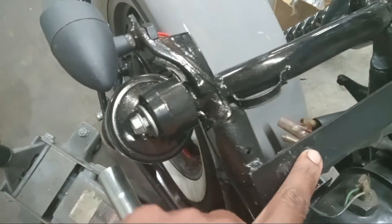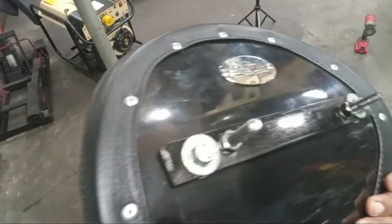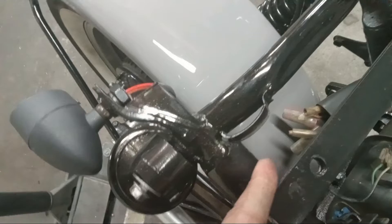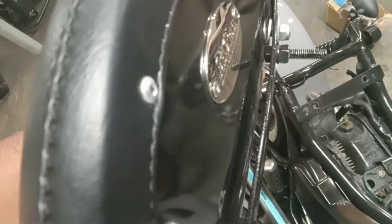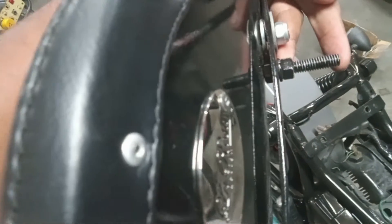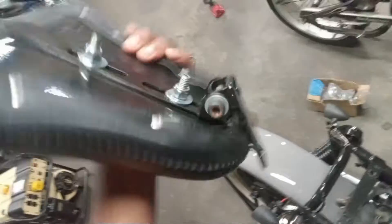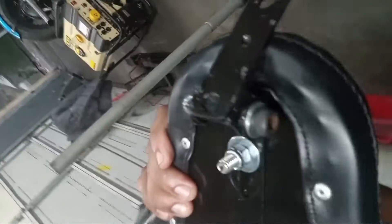These Loroza Design seats are about $50, not $90, but still good quality — I use them on a lot of bikes. I also welded a steel bar across here and drilled two holes. I'm not using springs because I made the seat too high and didn't like the look, so it goes straight in. The original mounting bolts wouldn't fit — they would graze the rails — so I grabbed another piece of sheet metal, bolted it on, drilled two holes, and added another bolt so I could mount it, and it fit perfectly.